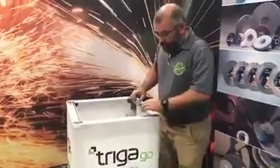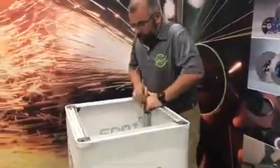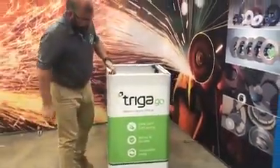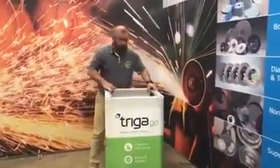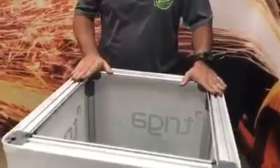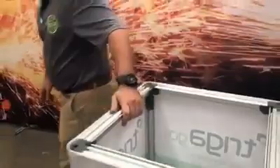It's looking a little bit fluffy — the tension, as I showed you beforehand, is just pushing down and releasing. We've got a nice tensioned print. The last thing we do before we fit the counter top is lock the tension — push up, there's a slight little lock, lock that across. Do all four of them. Now that'll give us a rigid surface to put the top on with no travel on the tension.